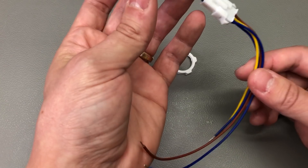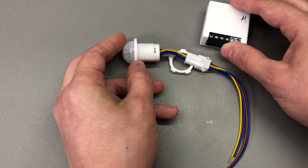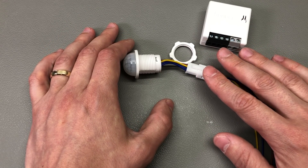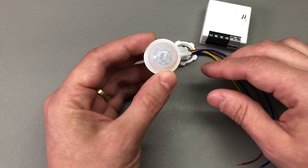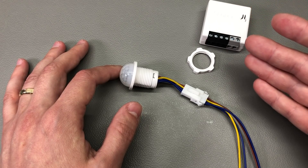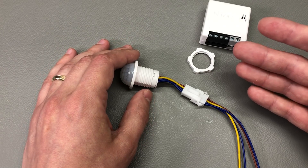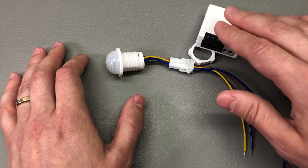Next I got this PIR sensor which is a 240V rated unit. My plan is to use this sensor as a switch input for the Wi-Fi relay and have the relay control a light fixture based on the PIR input. This gives me a Wi-Fi Home Assistant compatible mains-powered PIR sensor. I'm trying to stay away from commercial PIR sensors because they're pretty bulky, but using this little one I can hide everything behind the light fixture and it will look much nicer. The benefit of making it Wi-Fi enabled is that I can adjust parameters on the fly — like turning the light on based on ambient lighting or adjusting the on-time with a simple variable. If things work nicely, maybe I'll even create a product integrating everything into a small enclosure.